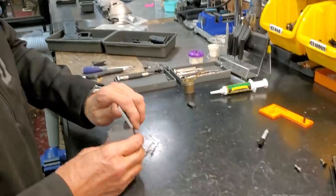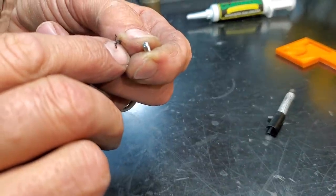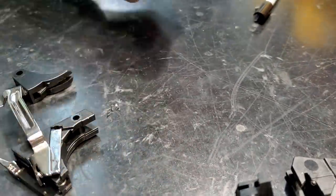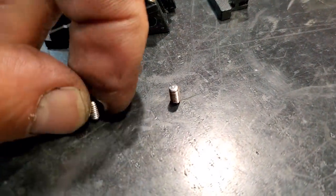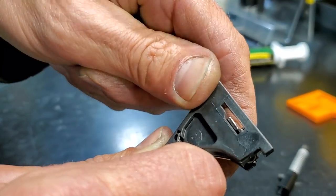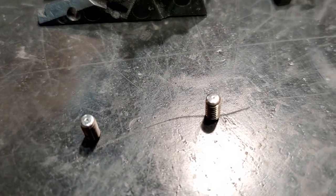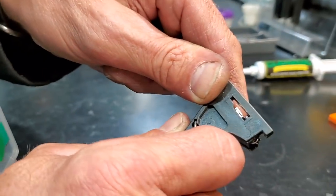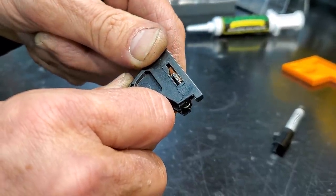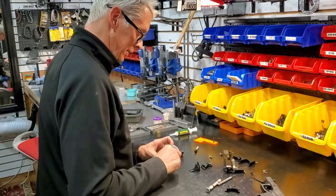At the end of the set screw you can polish it - same thing Wick does on every single one of these set screws. He takes them down so they're nice and flush and smooth, puts a little round on them. They're polished, so when it's metal to metal and this piece is hitting this, it's very smooth. All these little things are taken into account. If it's a dog-ear you could get a hang-up, a burr in there, and that trigger can hang and it's not going to want to move - the striker won't pick back up.